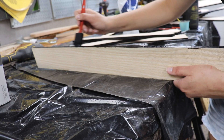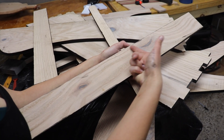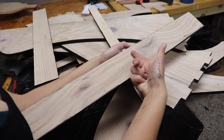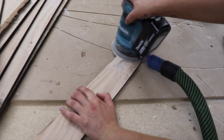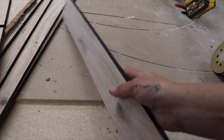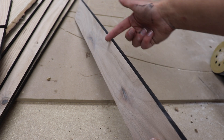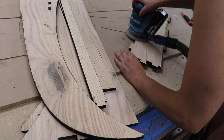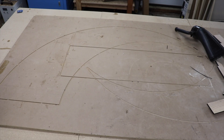I'm not bothering to be too careful with this because it's going on before the finishing sand. When I go in with a 220 grit all over the front and back of each piece, the sanding pad removes any black smudges, leaving a crisp edge. I want to point out that the result is matte, even though I used a satin Halcyon finish. Then I took my time and got through sanding all the pieces.